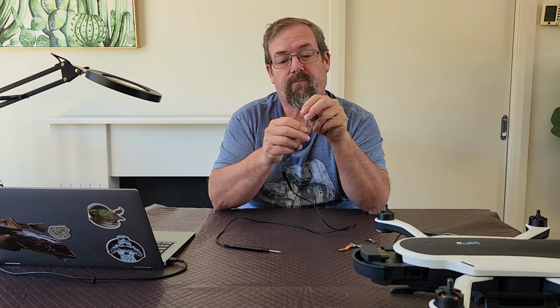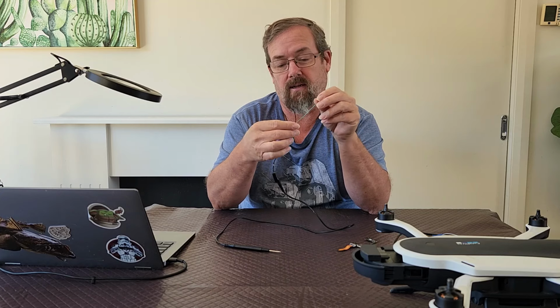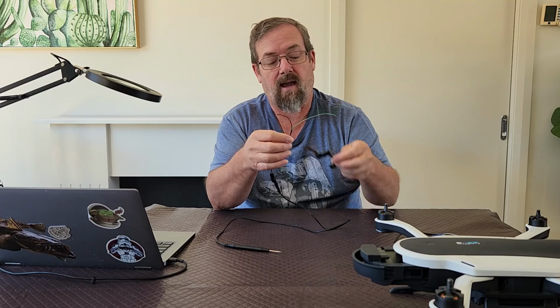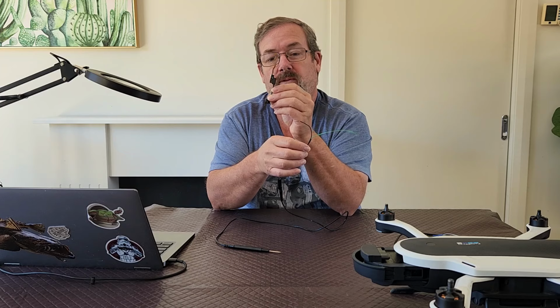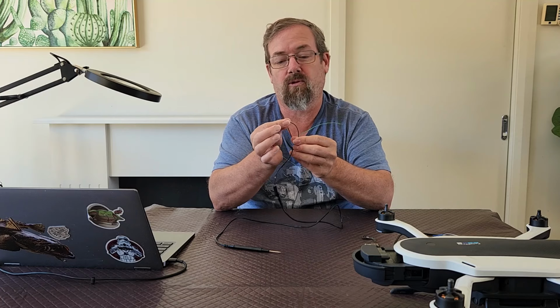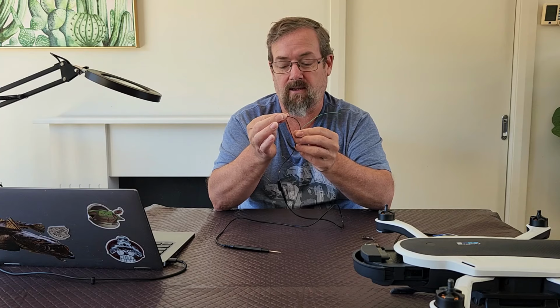The other one, we often solder to FB36 on the right-hand side. And what happens then is that power, the 3.3 volts, will go through to that FB36, and then that powers whatever board you've got. If you're using the onboard arm board, then you need to solder that to FB36. If you've followed our video and created a board, you can actually solder that onto the board you make itself. One of the pins will be nominated 3.3 volts. You can just tack that onto that.